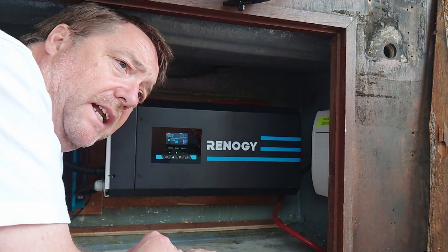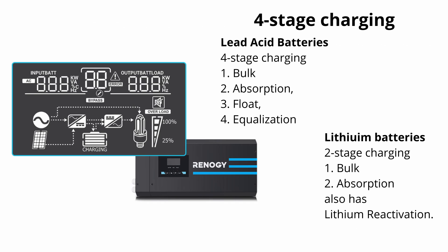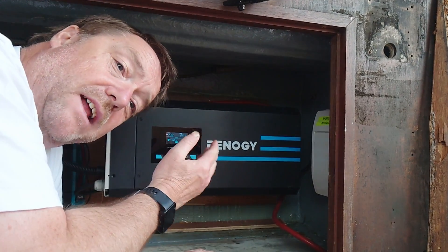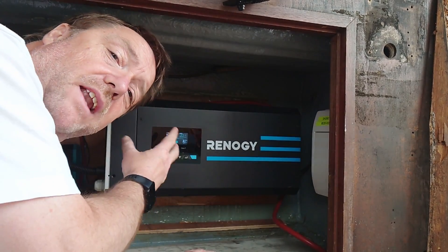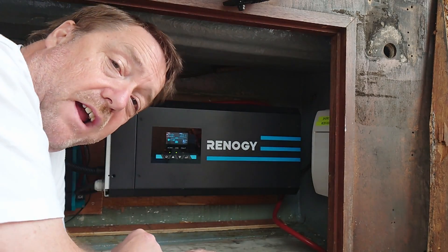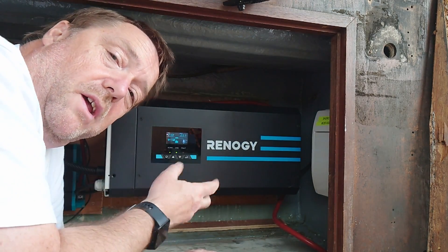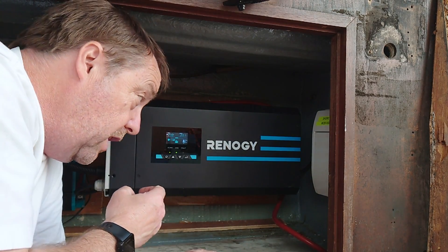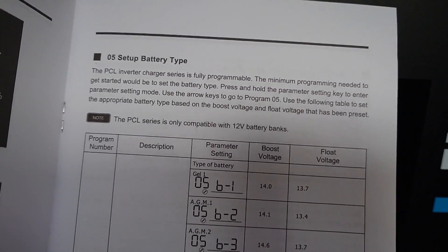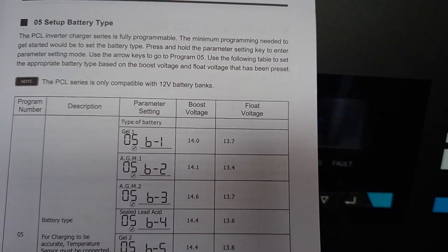This manages the lithium batteries and, like many good quality battery chargers, it has several different stages of charge. Firstly there's the bulk stage which puts a lot of power into the batteries, and then once the battery voltage starts to reach a healthy level the machine reduces the power down. The bottom line is you don't really need to know about that — it takes care of it all — and basically it means it doesn't overcharge your batteries, it continually manages them by giving them a little trickle charge so they'll last longer. Each of the battery controllers and chargers on this system need to be set to match the type of batteries we're using, and that's done in the software.